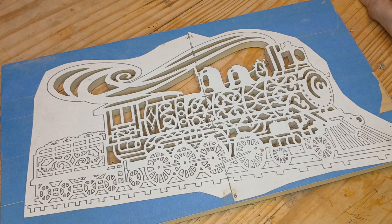Now there is a number 2 blade and I have some — I don't like them, and I'm not the only one. You can go read the forums; some people just don't like them. They don't seem to cut the same. One guy said they weren't for beginners — you just have to get used to them. I also have some metal cutting blades. For my wood cutting and scroll saw work right now, I'm using Pegas Modified Geometry. I still have some Flying Dutchman XL, which is a skip tooth offset tooth blade, but the Pegas cuts better — they're more aggressive, they cut straighter, and they cut cooler; they don't get as hot as fast. Once I found those and started using them, I didn't want to go back to anything else. But that's just my personal opinion.